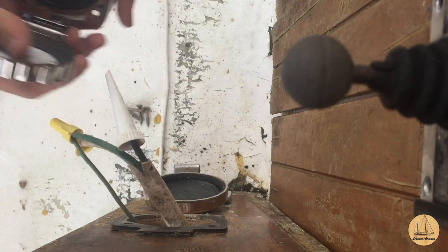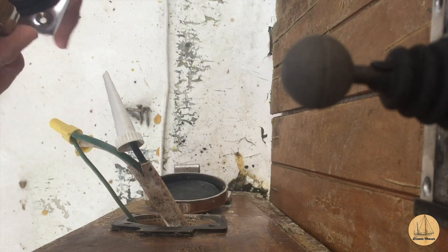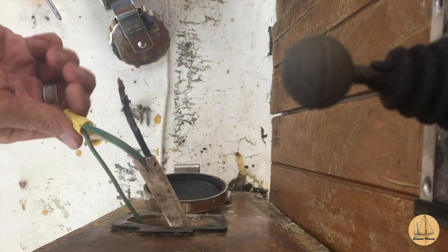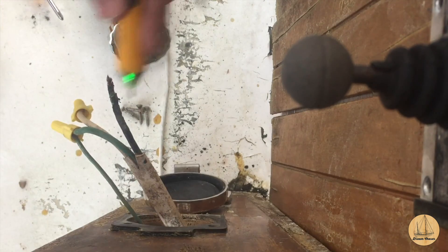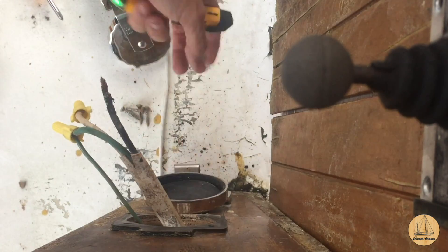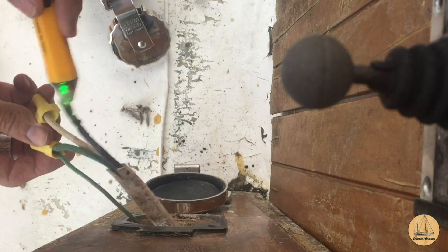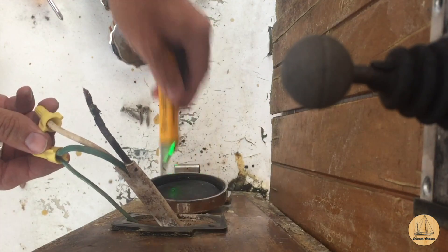I've got my new plug here and it's now time to get this stuff connected. The first thing we're going to do is make sure we don't have power coming from anything. I've pulled both power connections off, the generators off, the inverters off — so even if there was a wiring problem, I shouldn't get any back feeds here.